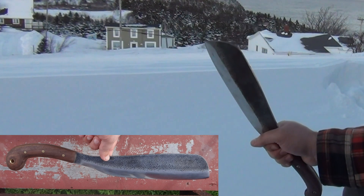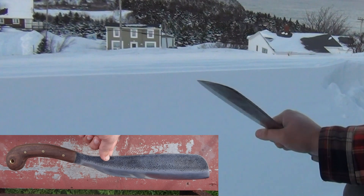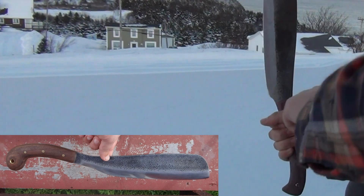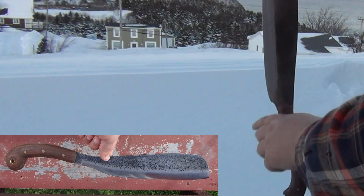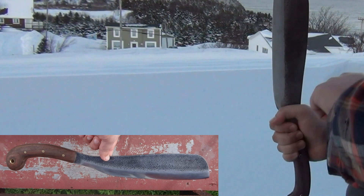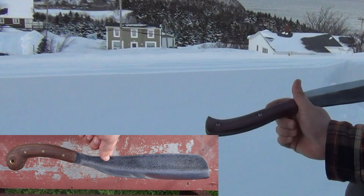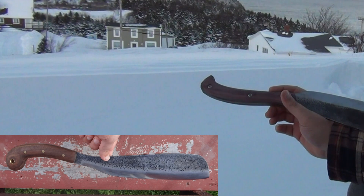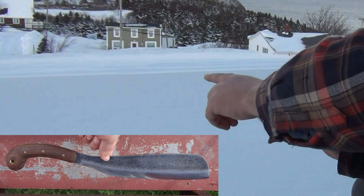This means there's not that much weight or torque in your hand, and it gives you maximum leverage for finer cutting. I wanted to bring the handle up a little bit more — it should have actually come up probably about a quarter of an inch more, because you want your thumb to be right almost behind where the sharpened edge is. But I only had a certain piece of purple heart, so I was limited in terms of length.